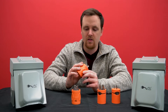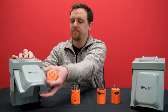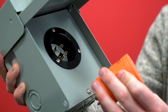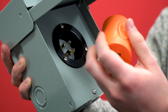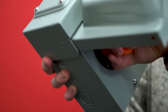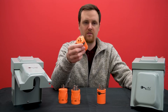AD515L1420 is mostly used for going from an L1420 inlet box to just a standard household plug connection, so you can run some pretty small appliances off that during a power outage. It just goes in there, you twist it, and it locks into place.